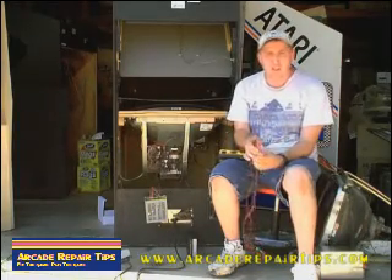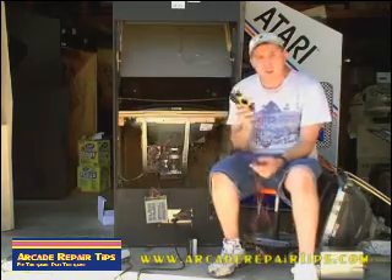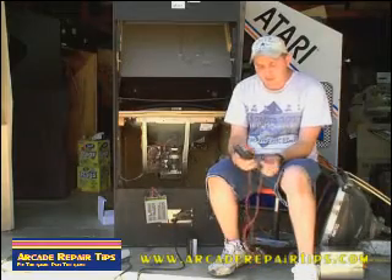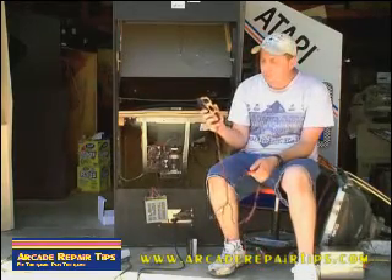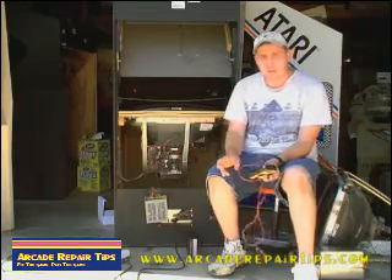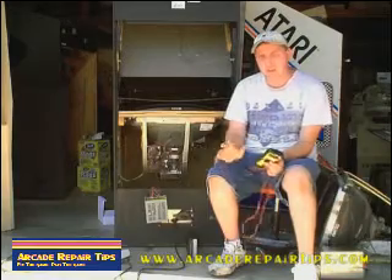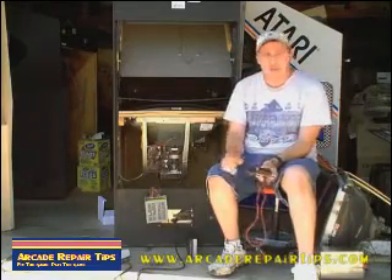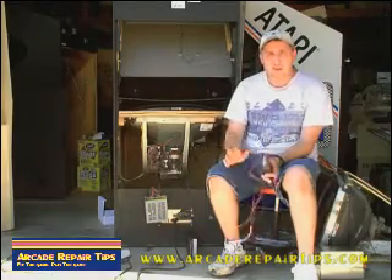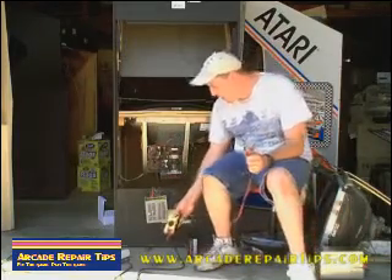You've just got to know what to check and when to check them. The first thing we want to do — you've all purchased your meter and you've got that ready — we're going to put it on AC. We're looking for your common voltage coming from your house, around 110 to 130. About 120 is perfect. But as long as it's 110 — you start getting over 130, be careful. So make sure that the AC voltage coming in is fine.